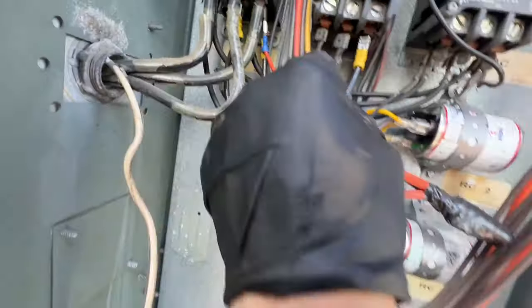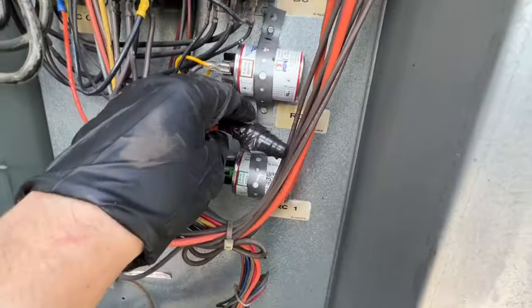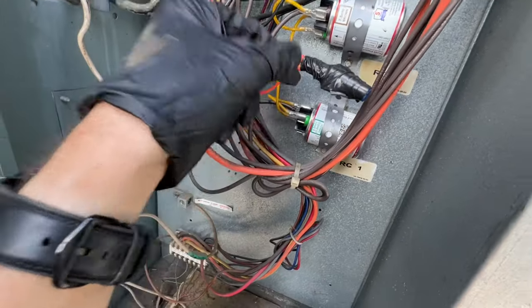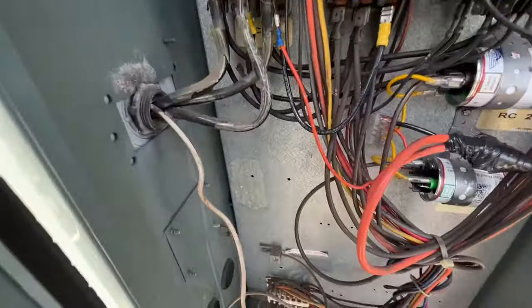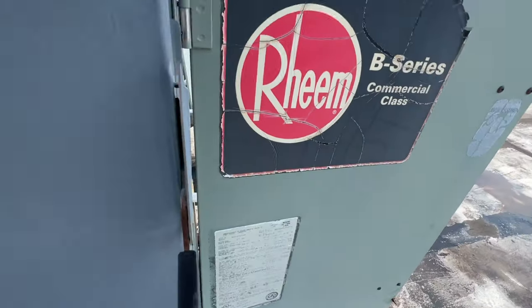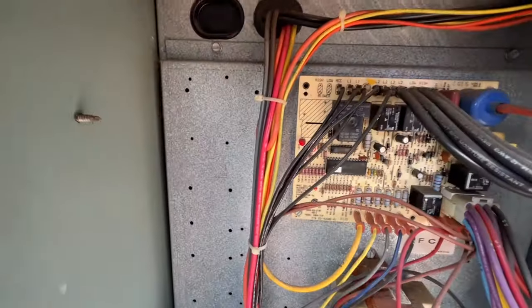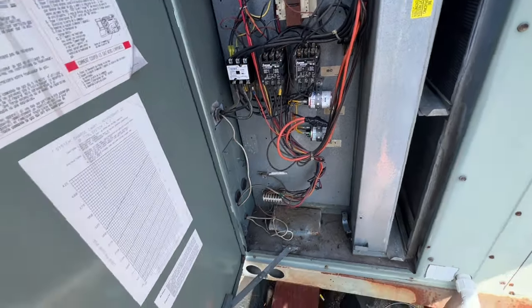I fixed up all of that wiring — ran a new black wire, cut back on the orange wire. I had to use a wire nut to tie these into a Wago because these wires are so thick, in order to wire commons up on the capacitor. That's all wired in and should be good. So when I apply power, the unit should turn on without any issue — that is if the thermostat is still calling. We got a solid light. I forgot to connect a wire — the fan wasn't turning on, but I reconnected the wire. I jumped it out here and everything seemed to turn on.